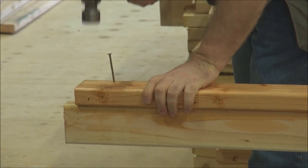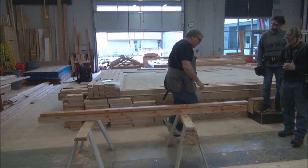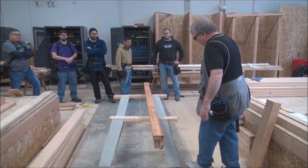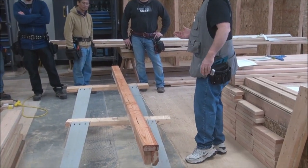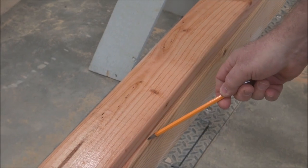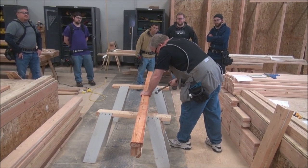Make sure things match up perfectly and that you're perfectly flush — it's a feel you look for. Once I have that together, I start working down the stud. If I come down here and nail it, I might have a bow — see this difference here? Down here we're even, but if I nail it here I have a problem: the stud doesn't match the edge. If I match this end, nail it, and come down and nail the other end, chances are I'll get a mismatch. So I come down about 12 to 16 inches, match it up, and make sure it matches.